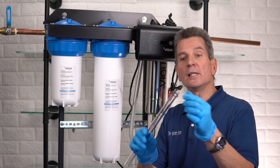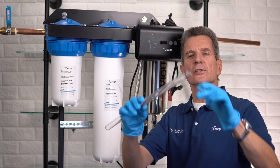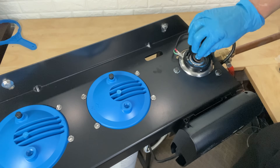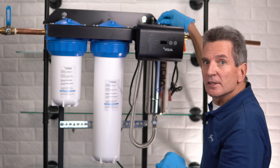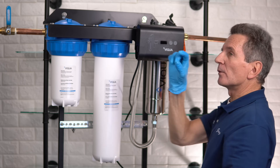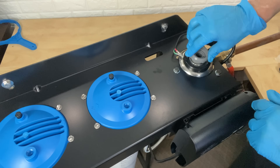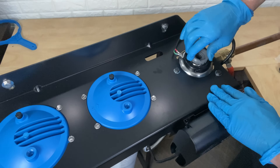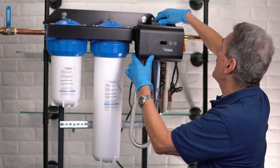Place the O-ring about three-quarters of an inch from the end, then feed the sleeve back in straight. When you get to the bottom you'll notice there's a spring that holds it in place, so a little bit will be protruding. Then grab the sleeve bolt, put it over the top, and screw it in — this only needs to be hand tight.